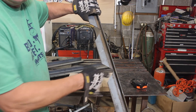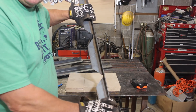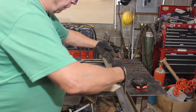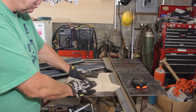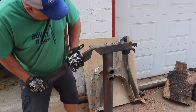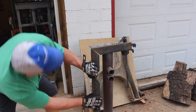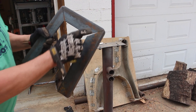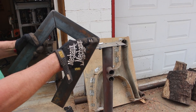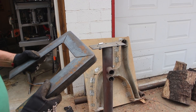I've cut a couple of notches out here — there's actually a tool made to do just that, but I don't have one so I've got to use a hacksaw. I'm going to fold these in and that should frame my bricks nicely. Now have a look at what's happened here — this is too tight in the corner, so I'm going to have to drill a relief hole and then maybe I can bring these in completely.